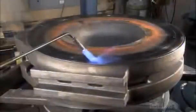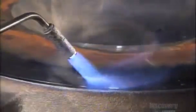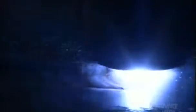Meanwhile, the wedge is ready. A propane torch preheats the wedge for the plasma arc welding machine. This machine hard-faces the sealing surface of the wedge, a process that ensures minimal wear. Hard-facing creates three rows of weld beads, which will be machined smooth.